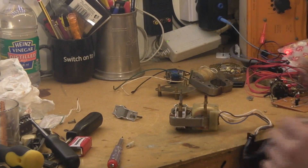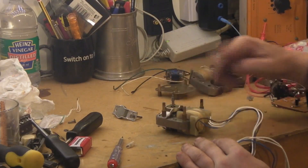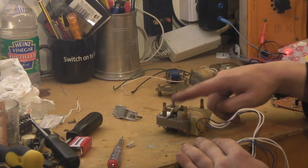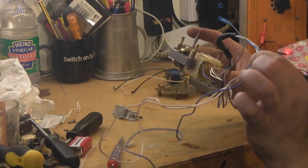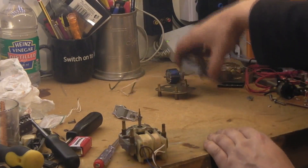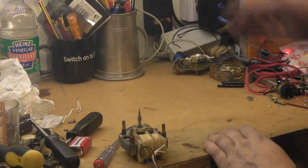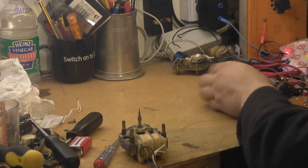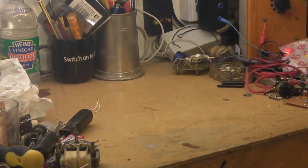There we go — that's the motor rebuilt. So basically what we've got is the spindle that's correct for that turntable off the old motor, rebuilt with the fixings off the old motor, but with the new motor that has the lower voltage tapping on the auto transformer. Let's get these leftover bits out of the way — they'll go in my motor box. I'll probably put them back together into a motor and it can go into my spares motor box. We'll bring the player back in and fit that motor back to the motor board.